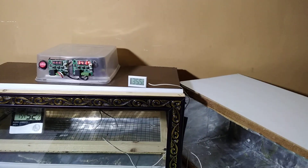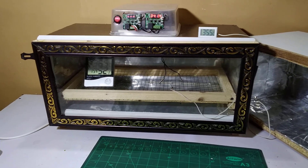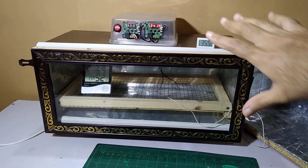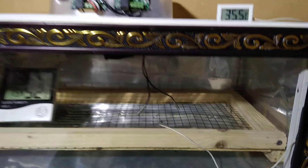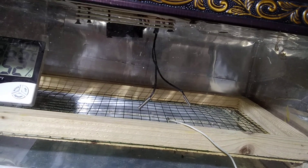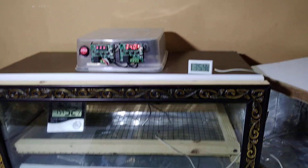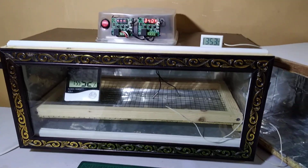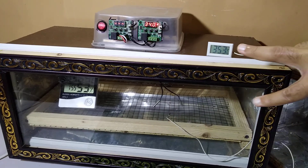This system can be used with any kind of heater depending on the capacity and size of the box. I have used the silicon heater for efficiency and low power consumption — it consumes only 70 watts, the fan consumes 5 watts, and each controller uses 5 watts. So it is around 15 watts continuously and 80 watts when the heater is running.